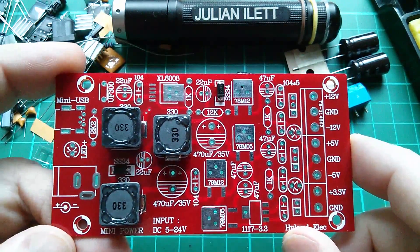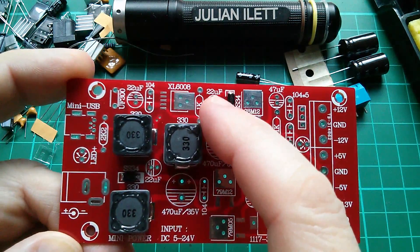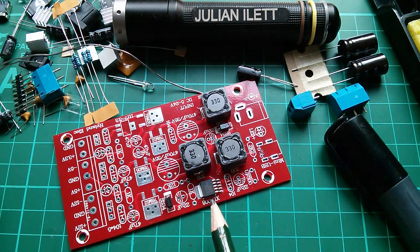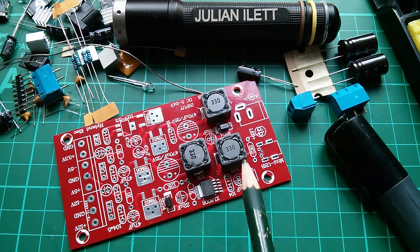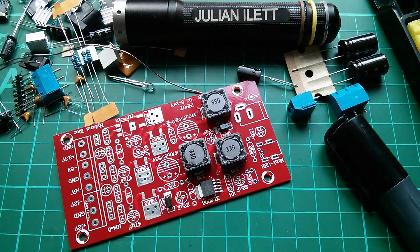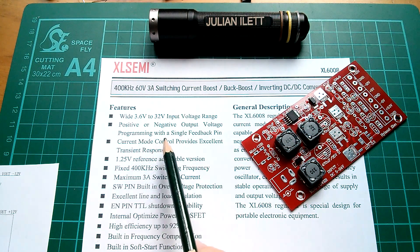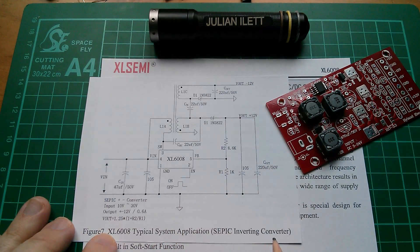There are the three inductors and the two diodes on. I'm actually only going to half build this today — I'm not going to put any of the linear regulators on because I want to look at this split supply with a single switch mode device circuit, because it's actually quite intriguing. Let's get the switch mode converter chip on there, which is an XL Semi XL6008. I've been watching videos of other people who've built this kit — Voltlog built this kit, and also Adam Welch. Adam Welch pointed out something rather interesting in the datasheet for this chip. The XL6008 has a wide 3.6 to 32 volt input voltage range, and it also says positive or negative output voltage programming with a single feedback pin. In that datasheet is a typical system application for a SEPIC inverting converter.